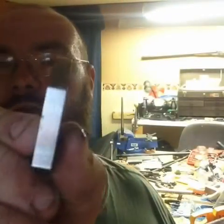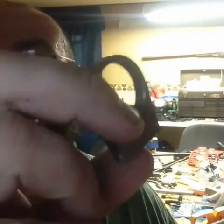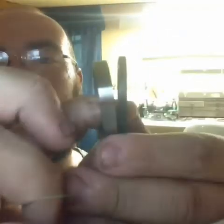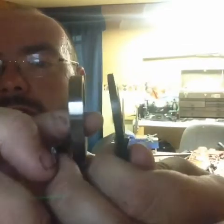This is an aftermarket. It's 1/4 inch thick. You can order these off of eBay and some other places that you can accurize them with. If you put them up beside each other, you'll see the difference in the recoil lug. Alright, and they have a little pin right here. You can also use these for Remington 700. But this, with this pin in it, that's for Savage, and that basically locks into your receiver.